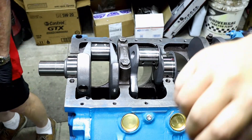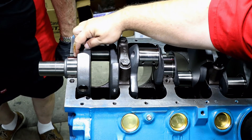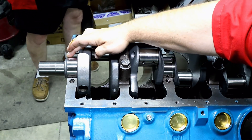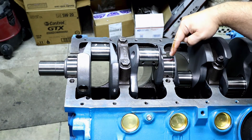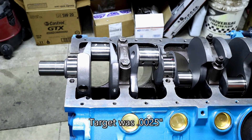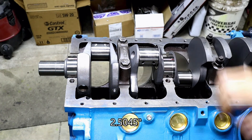Looking at these gauges — this side of the plastic gauge is a little bit wider than this side, meaning it's a little bit tighter over here. We don't want the oil gushing out that side, so there is a steady, tighter clearance as it moves from front to back. Looking at the center one, this is consistent — we are at 0.002, a consistent 0.002. So we are well within that clearance line because our calculated model was based off of 0.001 times the journal diameter, which was 2.5405. We're right within that line.